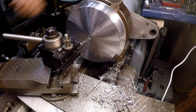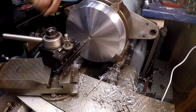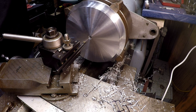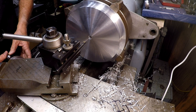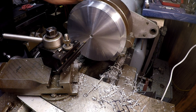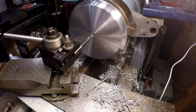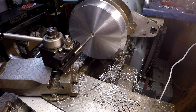That was better. Keep hitting my head on the microphone. We'll make one more quick pass now that we know we're good — get a little clean-up and then check the bore. I didn't like the finish I was getting — it was terrible with that boring bar, just too skinny. I thought it was going to work in the aluminum but 20-thou cuts wasn't working. Switched over to a Criterion high-speed cutter and I'm liking it.